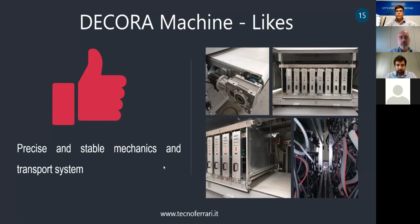So regarding the mechanics, we improve now the belt motor has been reinforced, so it's now 1.5 kilowatt power, okay, with a bigger motor reducer. So what we expect is double durability without any intervention. The same for the print block. So we reinforced all the print block, okay, we had the more thickness. Even the color bars are now bigger and reinforced.